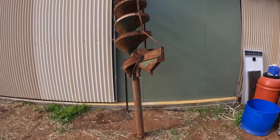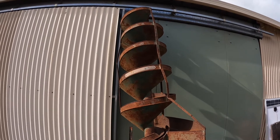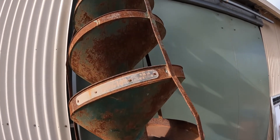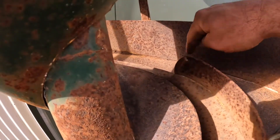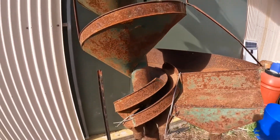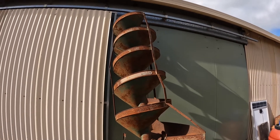This unusual-looking green spiral thing here is called a gravitator. It's a very simple seed cleaner made by Robert Boddington in Melbourne. The seed runs from a small hopper at the top down the spiral. The heavier seed goes to the outside, and all the light stuff stays on the inside of the spiral. These are one of the most effective seed cleaners that I have ever seen.